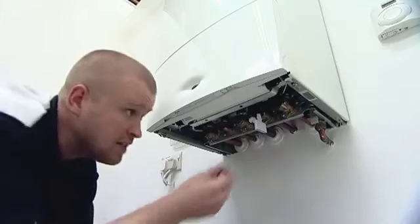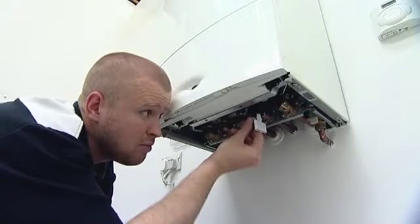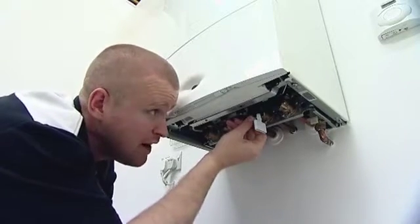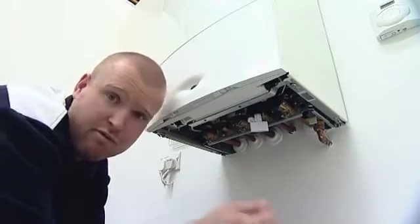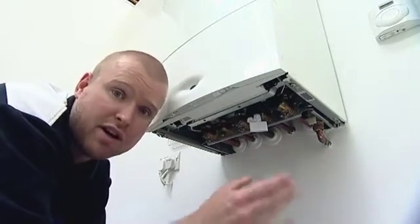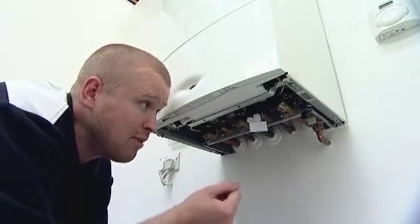So what I'm now going to do is begin to tighten this plastic spindle knob back up until I can actually hear the water stop. What I'm then going to do is turn the key back to the open padlock position and remove the key. Now before I remove the key, there's a chance there's going to be a little bit of water that comes out — that's fine. So if you've got a bit of paper or a bit of rag to mop that up, that's fine.